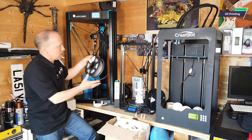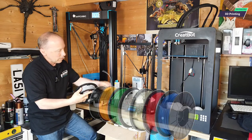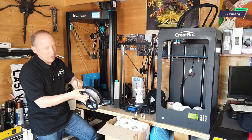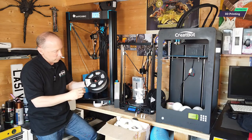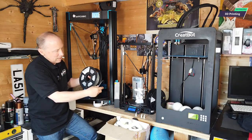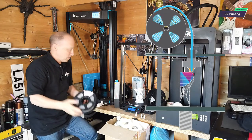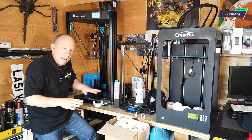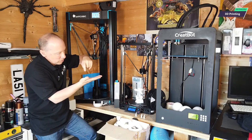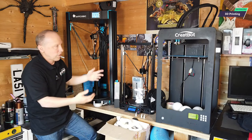3D printing basically uses this filament. This particular technology — FDM — uses filament, which is just plastic, basically. It comes in lots of different varieties: you've got ABS, PLA, PET, and loads more — we'll put some details in the description below. In essence, the plastic goes through a heating element, heats it up, and then oozes out of the nozzle and builds up. A bit like when you were at school making those clay pots — you'd roll sausages of clay and coil them around. It's exactly the same. It builds up coils of material, heated together into very thin layers, and builds up a product. It's fascinating to watch.